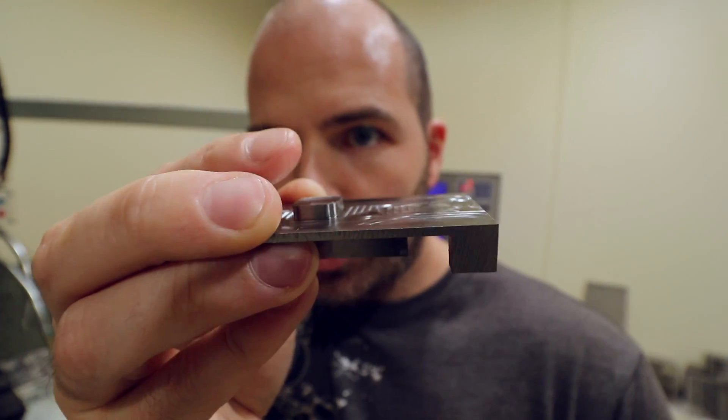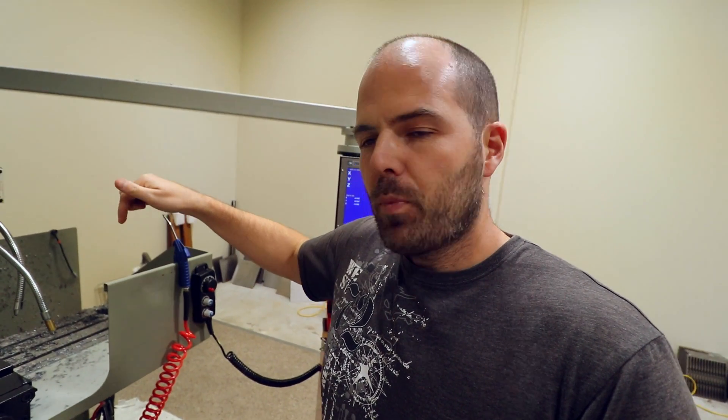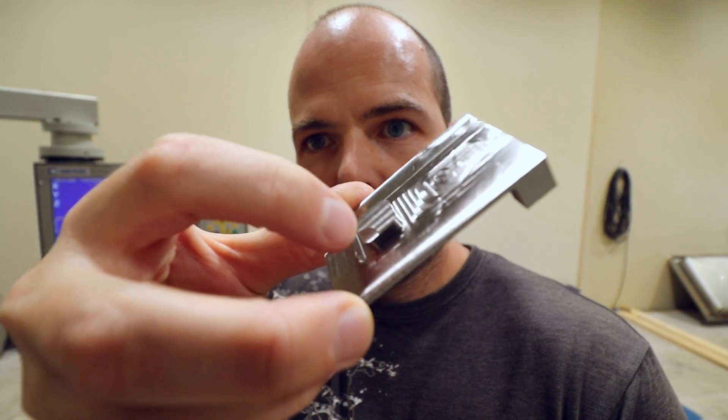What I still need to do is drill and tap so I can put the spinner on and then screw a 5mm bolt on, which will hold it. Because it's held in the centre, I can then just mill around it, bevel it, that kind of thing — same on the other side. The only downside is after cutting the spinner on the water jet, I still have to clamp it in the vice, touch probe it to find the centre, and mill the female version of this male fixture. It's got to be precise — no play at all — but I think it should work pretty well.